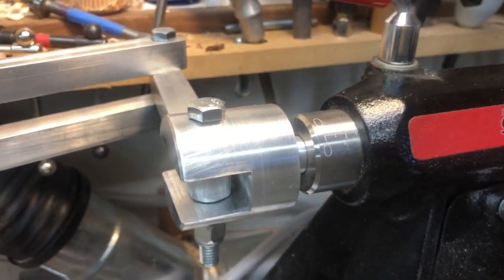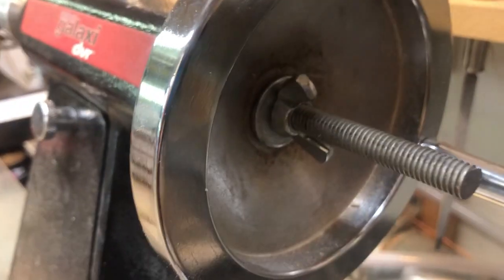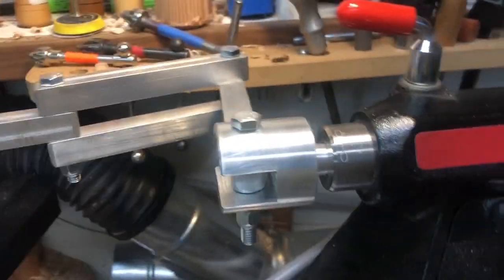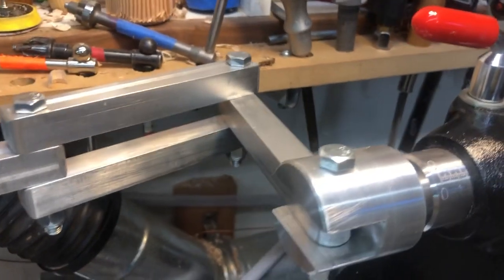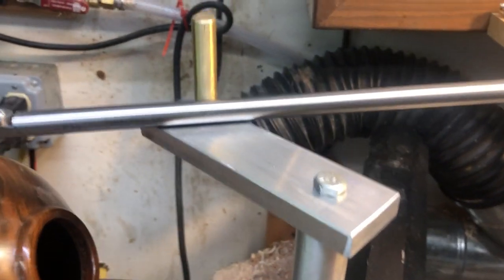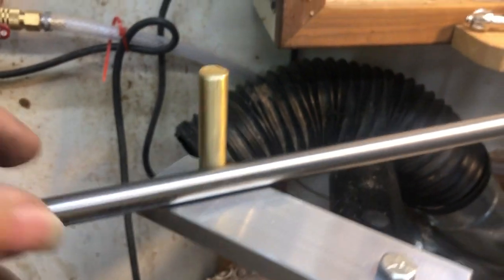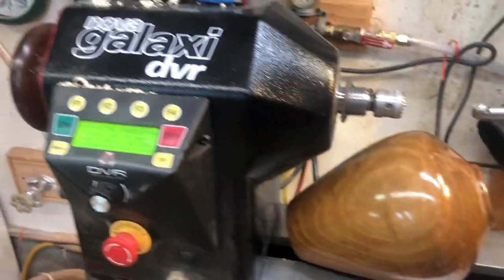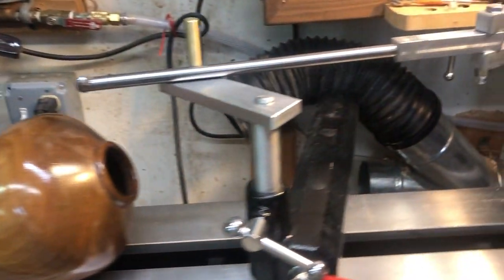It's in there with a Morse taper, and it also has a draw bar on this side so that it cannot rack either way. It's a neat little product. I also made a new tool stand for it, and there are little brass bars just to prevent it from going too far to the right.